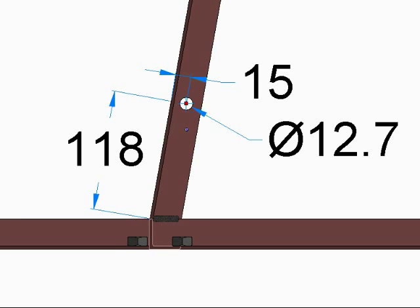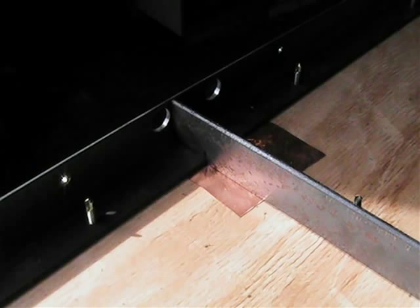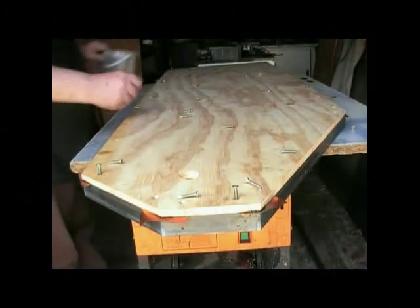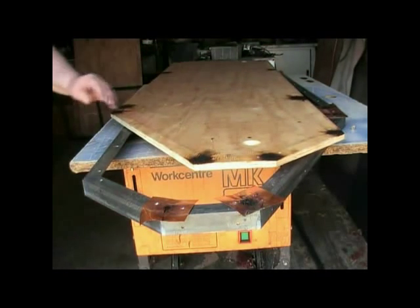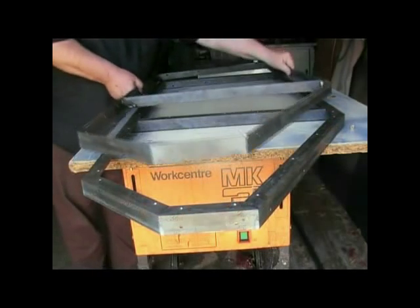I recommend that you pre-drill these holes before assembly. When using the panels as a welding jig, I suggest you screw the frame sections to the edge and shield the plywood with copper strips to avoid excessive burning and also to act as a heat sink. When the joins have been welded, you can now remove the screws from the panel, turn it over, and remove any of the charred plywood. A steel brush is ideal for this, as sandpaper will clog up very quickly.